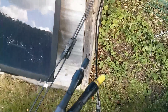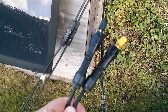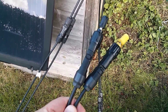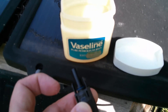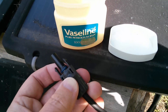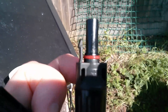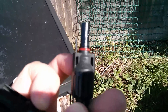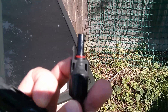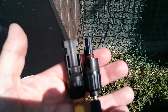So now I'm going to swap these MC4s for these MC4s, but I'll get some Vaseline because I don't swap these very often and it's probably worth weatherproofing them when I do. I'm just going to Vaseline the O-rings — that's all I'm going to do. One of the lugs has broken off this MC4 connector. I suppose with the sun on them all the time the plastic weakens eventually, but I'll probably make new ones anyway, so I'm not too bothered.